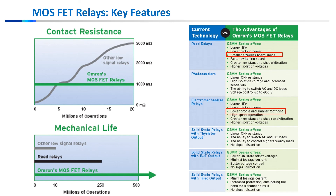Before looking at these products themselves and all of the options to choose from, I'd like to briefly highlight what benefits are brought by a solid-state vs. an electromechanical relay. Firstly, with the absence of physical contacts, the G3VM will experience no rise of contact resistance over time, as compared to a mechanical type, and this contributes to a much longer life of the MOSFET. The relays can switch both AC and DC loads and allow a great deal of space savings in the end products.